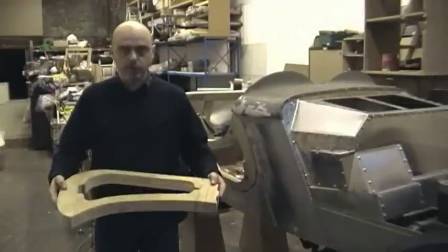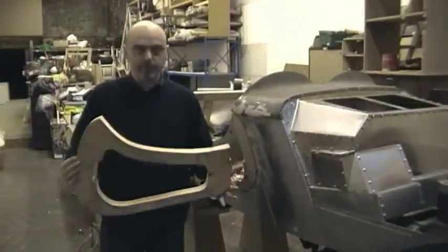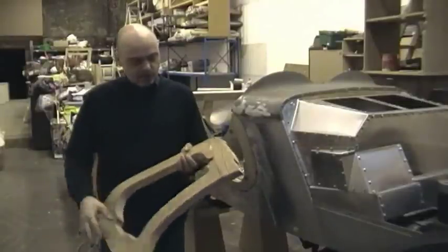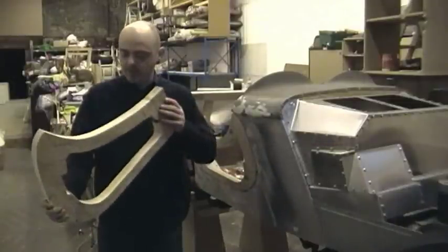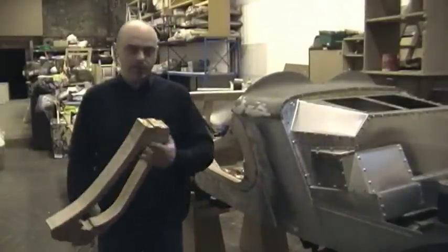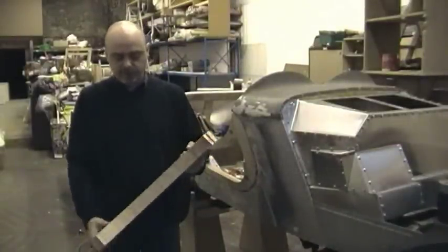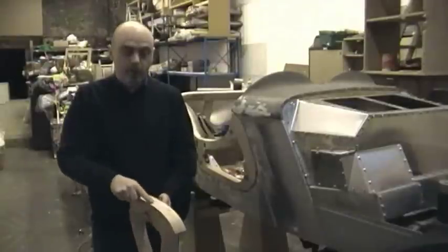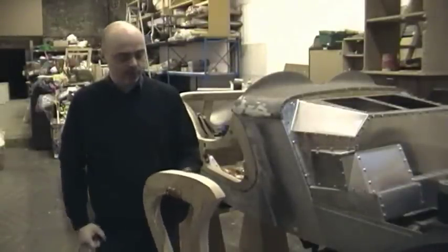This is the door in the rough — this is after the template I showed you, with the bits cut out and just loosely nailed and with light screws so that it can be shaped and put into position. What I'm going to do is fit this to the car next, put the hinges in which I've already let in, then loosen the fixings, twist the whole door into shape, mark it out for the door aperture, and actually shape it with a hand plane.